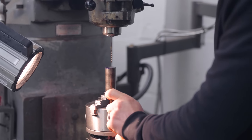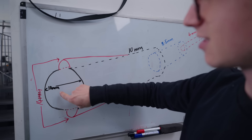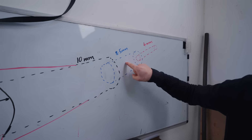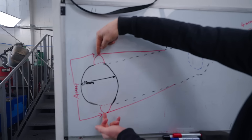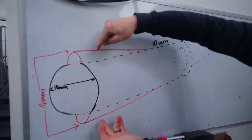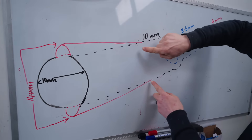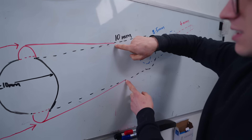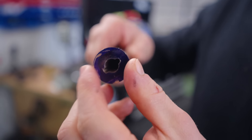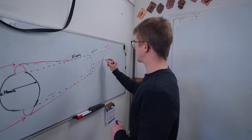I hope that's all the milling I've got to do. There's a hole for accepting the tang. It starts with a 10mm hole that goes down to an 8.5mm hole and finishes with a 4mm hole. The end milling on the sides is at a 2.5-degree angle, sloping down from 14mm wide at the opening all the way down to just the 10mm diameter. Those milled slots are going to retain it from twisting, and we should end up with a really nice smooth tapering tang all the way down.